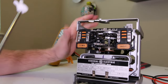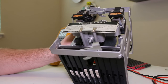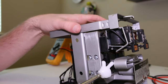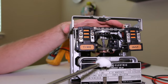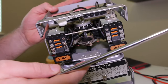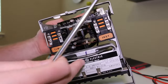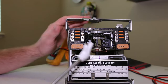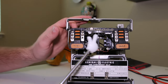Everything is adjustable. If we need to adjust our taps or pickup - the amount of current that starts it rotating - we loosen off this little nut and slide the drag magnet. This big unit is called the drag magnet and it slows down the rotation of the disc. Having it further out requires more torque, meaning more current. Bringing it back into the disc requires less torque, so we can adjust our pickup value to get it within range of our tap setting.